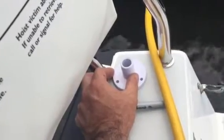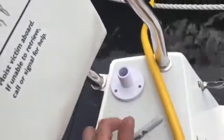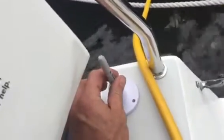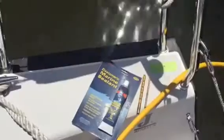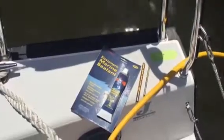We've got our base for our GPS antenna and we've located where we want it. Now we're just going to take our pen, mark right in the middle, and get ready to drill our hole. We've got our Sudbury elastomeric sealant — a great product that will hold to plastic, rubber, and pretty much everything else — and that's how we're going to seal the hole.